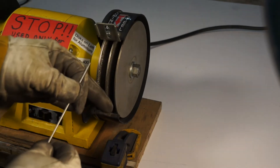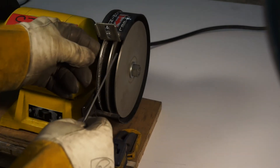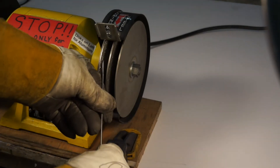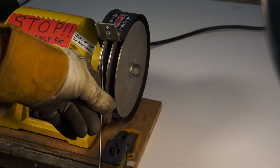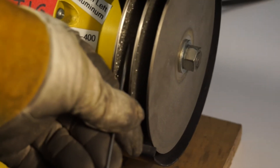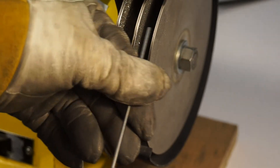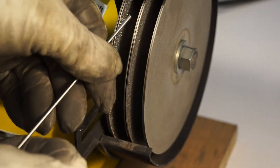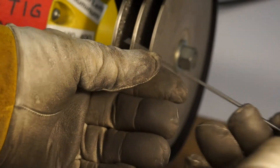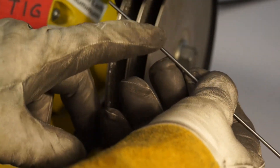What's nice about this is the angles — I have a series of washers in there to take up the differences on this longer threaded arbor, and it actually sets the angle for the tungstens themselves. Each one for steel is on the right-hand side of each disc, and aluminum is on the left-hand side of each disc. When I'm all done, I'll actually cradle it and blunt the tip against that, then follow up on the other side and clean off any precipitation residue that's on the tungsten from welding.